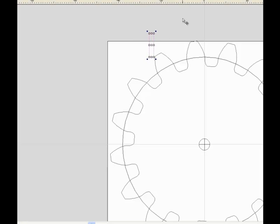Now the reason that this is important for you to know is that in future, in actually this coming release of Gearotic Motion, you are no longer limited to involute gears. You can do epicycloidal gears, you can do timing pulleys, you can even do bicycle sprockets, all on the fourth axis. But there are things that you're going to have to consider and things that you're going to have to look at due to limitations in the fact that if you don't have a base circle or an involute curve, the mathematics is not as straightforward and cut and dried as it is for involute math.